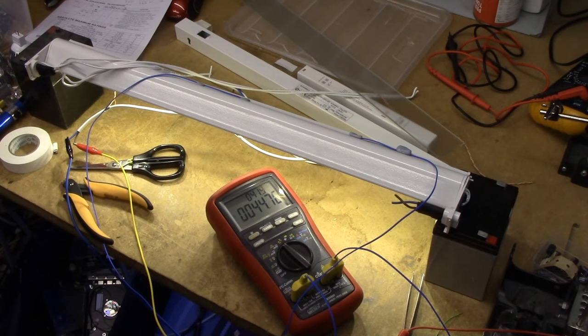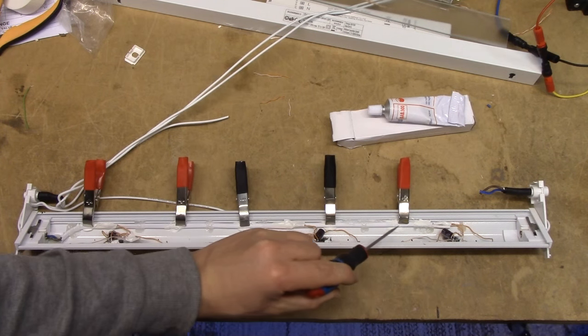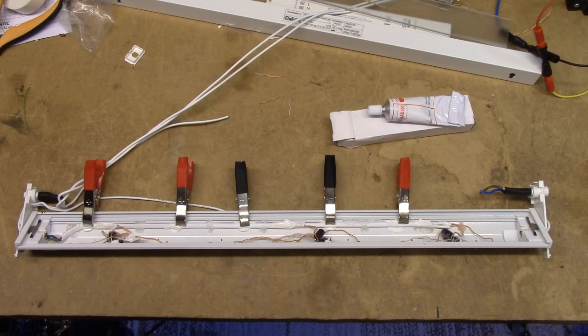Now all I've got to do is mount the drivers to the actual fixture and connect up all the wiring, and then it'll be all done. Everything's gunked up and gooped down. I used the same white goo to secure the busbar to the aluminium enclosure, but I also used some hot glue to stabilise it until the goop has settled, because this stuff takes quite a while — it can take up to a day or two. Indeed, wrangling all the circuitry had actually knocked an LED loose so I had to re-glue that. The hot glue should do a good job at keeping it in place, although it's going to lose potency once the thing warms up to operating temperature.